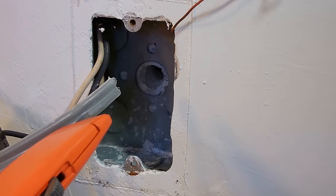To secure the box to the wall, what you're going to do, there's a couple of indentations, one here and one in this area up here. Take a 3/16 inch drill bit, drill out these two areas, because what you're going to do is you're going to take a tapcon, two of them, and use these to secure it to the wall. You're going to use a 5/32 inch bit. This is sold for tapcons. Let me place the box in position and then go to the next step.